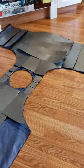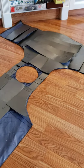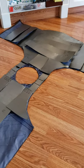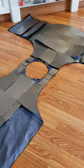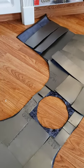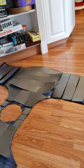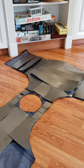The steel I chose for this one — since it's going to be just for duels — is the minimum thickness for hardened steel, which is 0.6 millimeters or 0.025 inches. It's 4130 steel from Aircraft Spruce here in Canada.